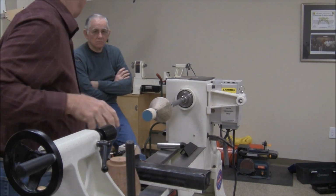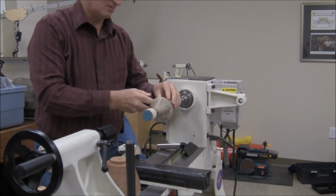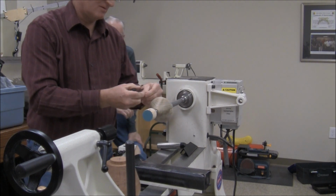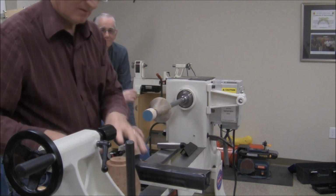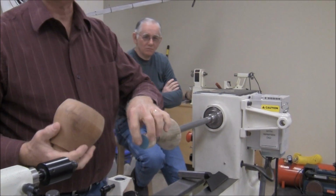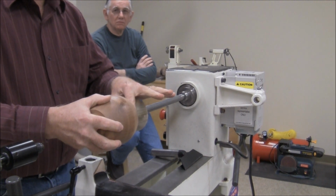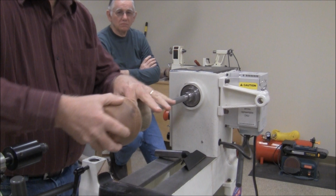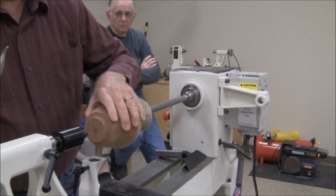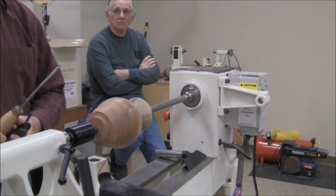So what you do is try to find the right size Allen wrench. Which is always a challenge. It's a wooden rubber chuck. It is. And this is not deep enough, but this will seat against the bottom of your hollow form, just like that. And then all this does is push down and fill in this space. There is no gap. And then you bring the tailstock up, and you just tighten it up. You bring your tool rest back and you just take the bottom off.